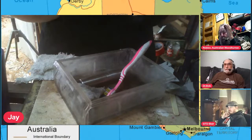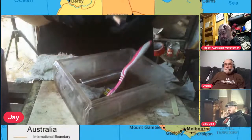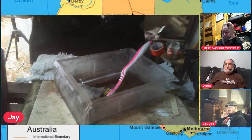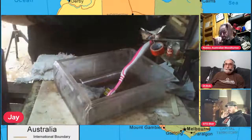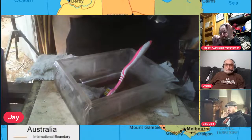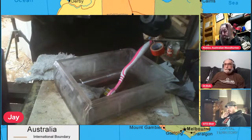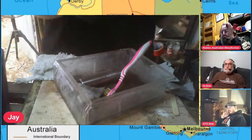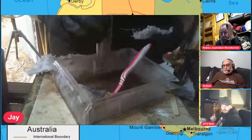Just wipe it down before you try and put the wheel back on it. Beautiful. That's the way it should fit. Right. Now it should rotate around the shaft without... Yeah, that's beautiful. Good. What happens is people let the grub screw come loose and then they tighten the tailstock up all the time, and the little grub screw is as hard as the hobs of hell, and it dints the steelwork on the edge and just locks it in like a key. Yeah, I've seen that before on stone stuff. Yep. Rightio. Okay. Now, dry off your quill and everything and put all that aside, and then get your tailstock body and start cleaning that out.